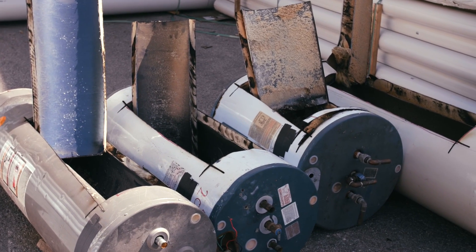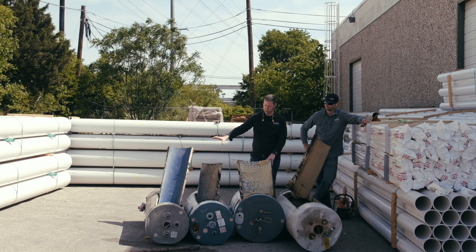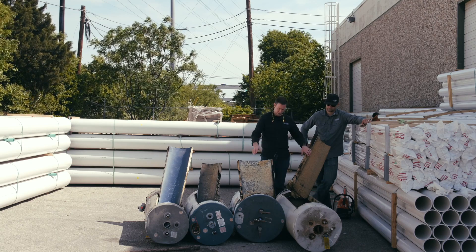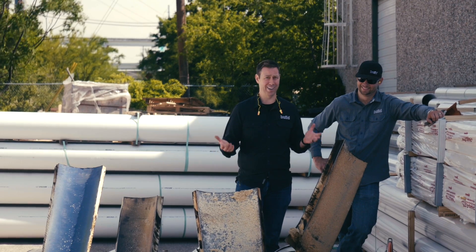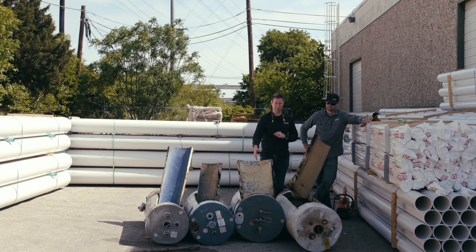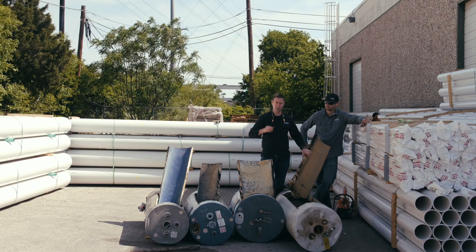Very interesting and varied results inside these four units. The 2005, though actually fairly old, had very little scale and nothing building up on the walls. I think regular flushing would have kept these units in good shape. I also wonder if the 2005 model had a water softener. The older 2000–2001 units had a lot of scale — one was absolutely disgusting. Have you ever taken a shower and gargled with the water? I wouldn't do that, especially if that's the unit in your house. I'd love to know your opinion — if you're a plumber or a chemist, tell me what's causing these differences. You can't say it's electric versus gas, and these were several different brands — I didn't want to call out any particular brand. Post a comment below.